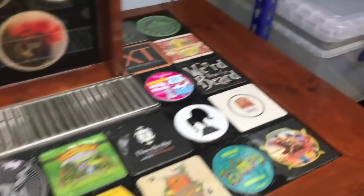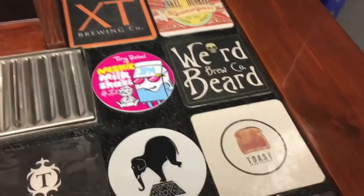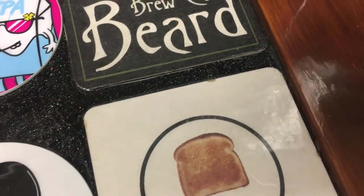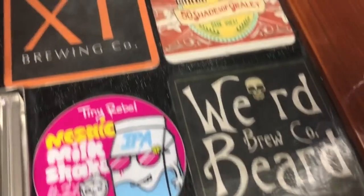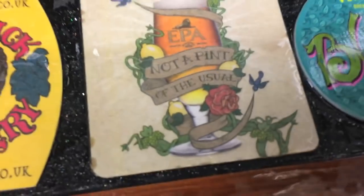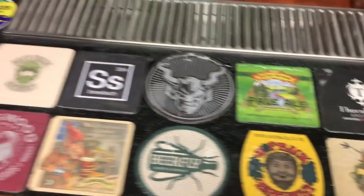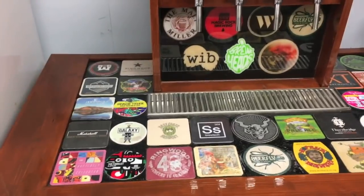The sealing coat is done. It's definitely helped having the plastic on the top and the PVA around the edge. There are a couple of little areas on the lighter mats where you can see the epoxy has just crept in a little bit, but it's nowhere near as much of a problem as it was on the backboard. Once that's dried out it should be much less noticeable.